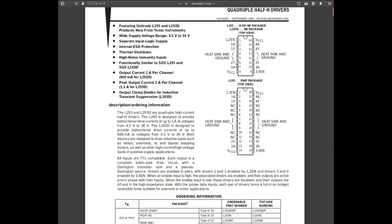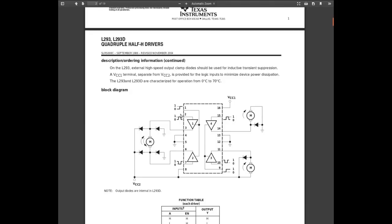There are two control connections for each of motor one and two. Pin two is the control and pin three is the output to the motor. Whether you send pin two or pin seven high or low controls which direction the motor goes. To stop it, even with PWM pulses happening, you can just disable it on the enable pin — same goes for running it as a single motor bidirectionally.